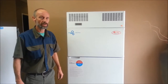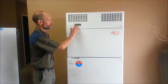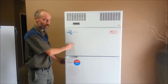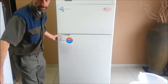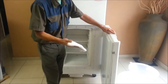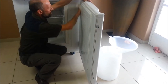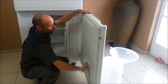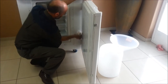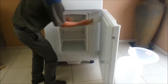The daily and weekly maintenance tasks are as follows. On a daily basis, the temperature should be checked to see that it is within specification. On a weekly basis, the unit needs to be opened and a clean absorbent cloth is to be used to wipe any condensate on the face of the door, on the seals, and on the face of the cabinet.